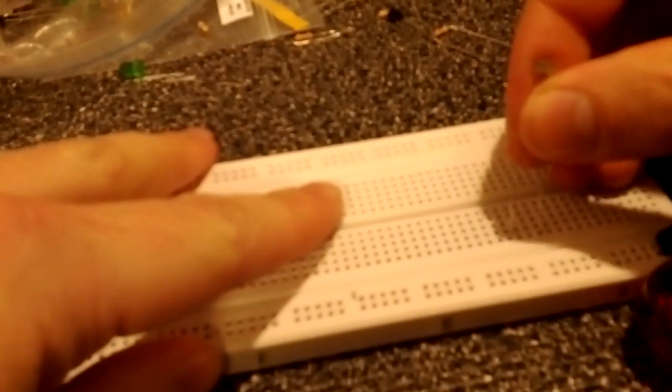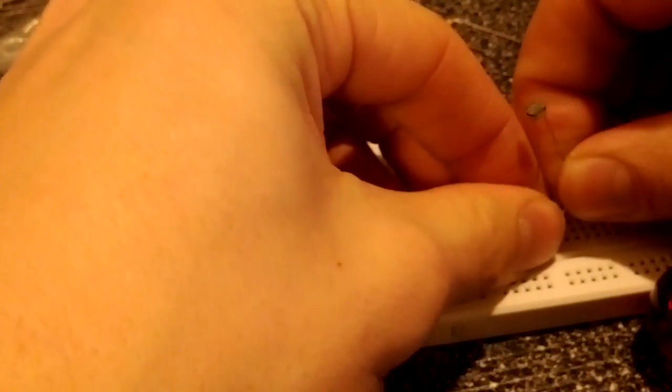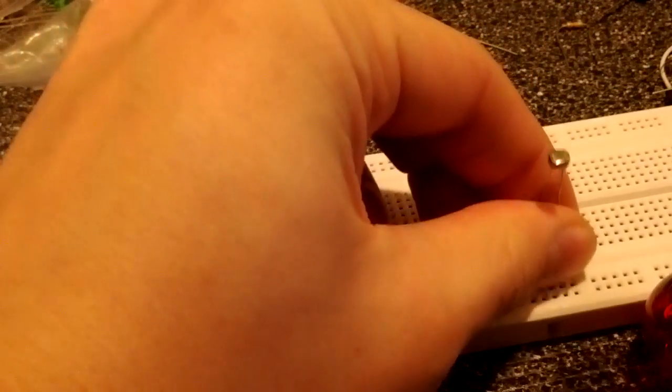which is quite a bit. So we'll throw this in our breadboard, and we think, 2 million ohms. If I want to use some kind of voltage divider circuit or anything else to really control a transistor or a relay or a MOSFET to turn on an LED, 2 million ohms is going to be ridiculous. So that just happens to be the specification of these photoresistors.